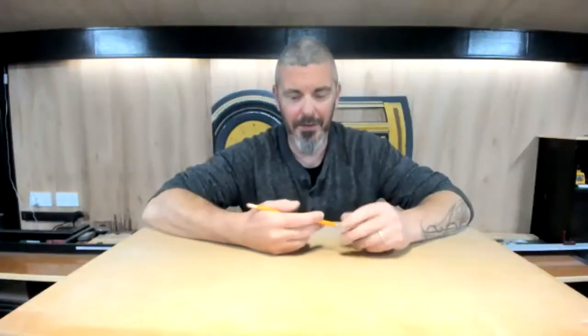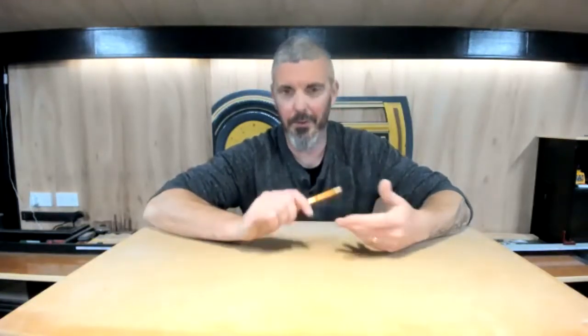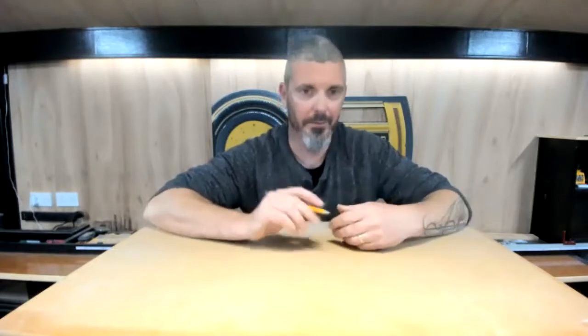Now, the disadvantage with spraying is you have to mask things off. A buddy of mine in the States is a professional sprayer, and what they say is they go into a house, and if the job is taking 4 days, they spend 3 of them taping things off and 1 day painting. So there's quite a bit of prep, especially indoors, because whether you're covering floors or furniture or windows or doors or whatever you're covering, that takes time.